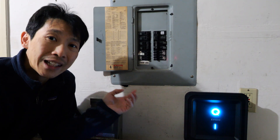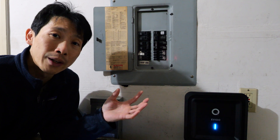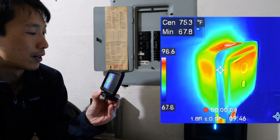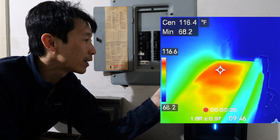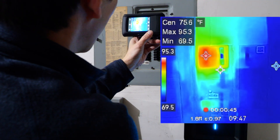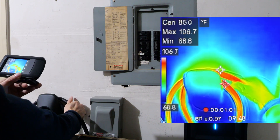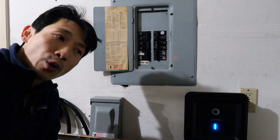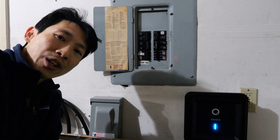Sometimes old breakers fail and heat up a lot more than others. To demonstrate, I've been charging something on one of the breakers so it'll be quite warm — this is what you'd see with an older breaker that has too much resistance; even without pumping a lot of current through it, it heats up more than usual. The charger center reads 86 degrees Fahrenheit, the top is quite warm at 106, and there's a hot spot right in there at 116 degrees. Checking the breakers, we see a hot spot of 95 degrees, which is within normal range. The cable reads 105 degrees — warm to the touch but not hot. This is very useful for checking any electronics; if something is over about 130 degrees, it's probably broken, whether it's a component on a PCB or a circuit breaker.